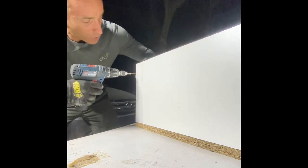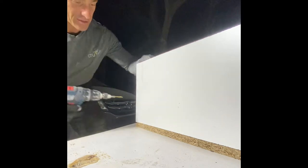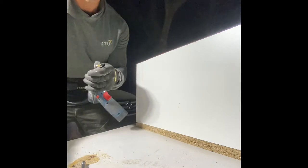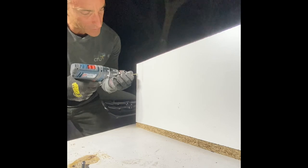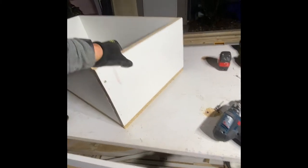What I'm doing here is piloting some holes. Remember, we want to squeeze on the side because when we pull on the drawer we don't want the pressure coming against the screw and pulling it out — this keeps the screws more secure. I just do a little pilot hole, then throw in my bit. Any wood screw will do and they go in pretty good — just make sure it's centered in the wood. I make sure it's flush, and the drawer is coming out really good. You can see I've glued the sides and the base, and in just a minute I'm going to put the wheels on.